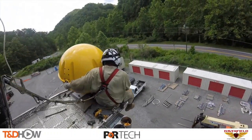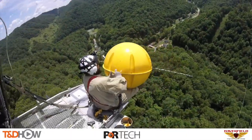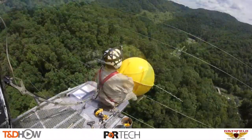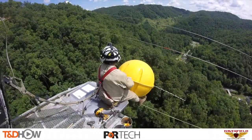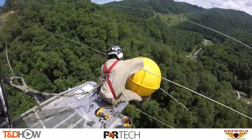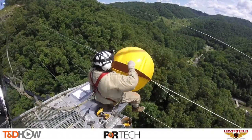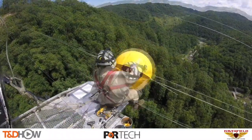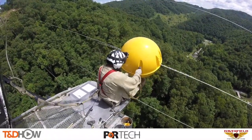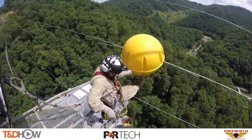He positions the marker ball right next to him on the platform as the helicopter goes back up and approaches the conductor. You can see those plastic ties he'll use to hold the ball. As we approach the line, notice the orange marking on the conductor. He simply opens and clamps the clamshell around the conductor itself. Next, he takes a magnetized cordless drill or wrench and tightens the nuts down on the bolts on the open side of the clamshell.